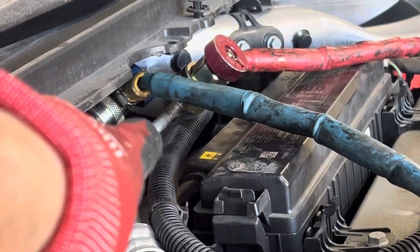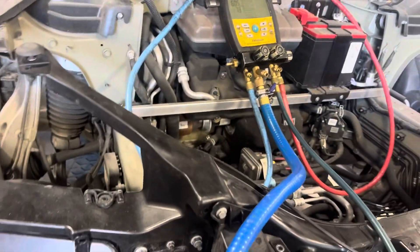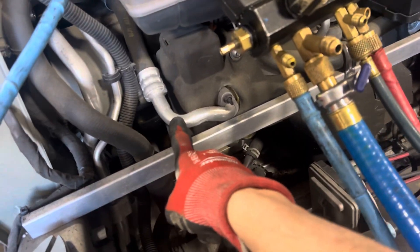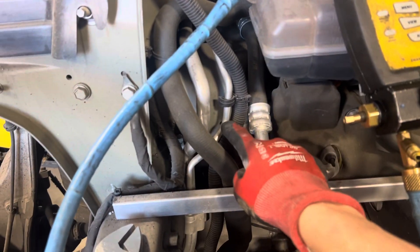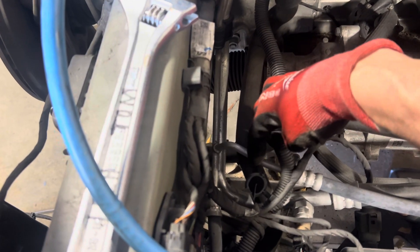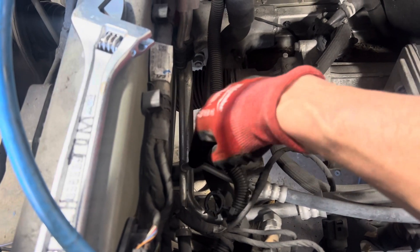The high side — there's the liquid line right there. Here's the compressor and the sound deadening blanket around it. That's your electric compressor. Here's your suction line, here's your discharge, here's your liquid line. The suction line comes back and you can see where the liquid tees. Right here you have a T, and right here you have another T.